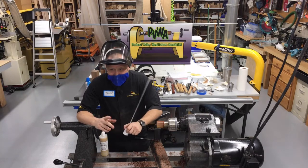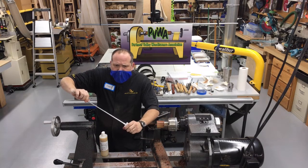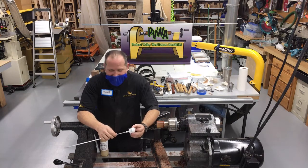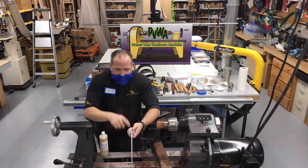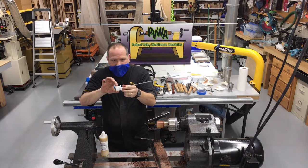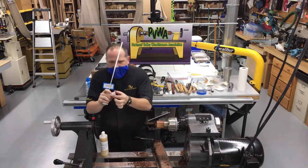I put too much before, and I put it all together, and I'm letting it dry, and I grabbed the top and that epoxy was in that mechanism. And acetone works pretty good if it's not dry, if you realize it in time. But yeah, it was a mess. So just a little, and I put the epoxy in the bottom there in that second shelf to get it about right here. Because this has little holes right there, it'll seep into those holes. So you just kind of want to get it that deep, and not enough in there that when you push it in, it just takes it all with it and dumps it all down there. You don't want to do that. And then same thing up here, just a little bit to where it'll line up with this.